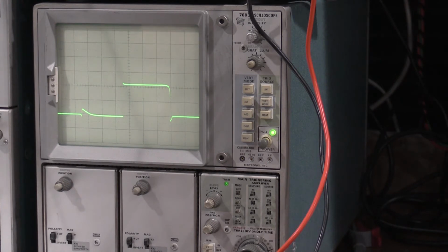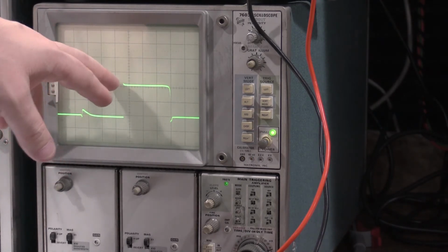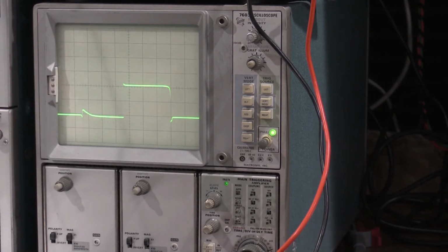And after a bit of fighting with the airline, we have a functioning tunnel diode pulse. So this is what it should look like. There's a slight pulse in the beginning, the very fast step, flat level, and then comes down. Everything is nice and stable. I can move the cord around a little bit, but you can see just the environment will change it just a little bit. So I've got to tighten everything up, make it all good, but good tunnel diode pulse,